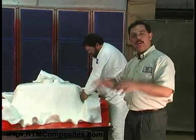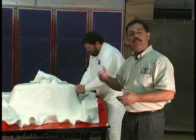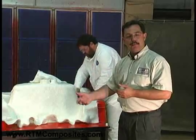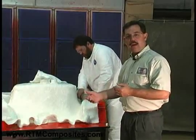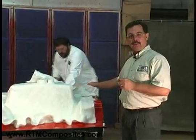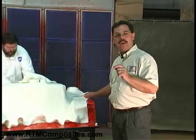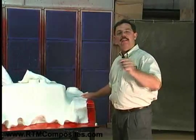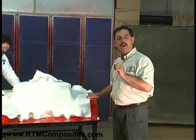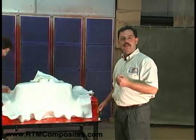The release agents, the resins, the fibers — we've all worked in harmony today, and we now have a very practical, simple process, one that generally a moderately skilled operator can do repeatably day in, day out. When we get to the injection, you'll see that we've taken advancements here at JHM to bring the equipment in line — much like the injection molding industry — with a single fire-and-forget type of technology: one button that injects the resin into the mold at precise process-control measurements.